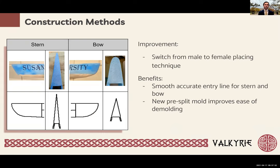To fix this issue, our team has come to the conclusion it is best to convert our male mold into a modified female fiberglass mold. This female mold will come in two easily detachable halves split down the center line of the canoe to make the demolding process simple and efficient. In doing so, we can anticipate that this mold can be reused for many years down the line.